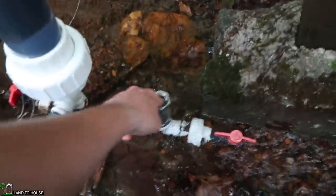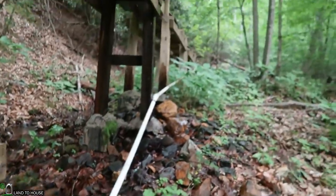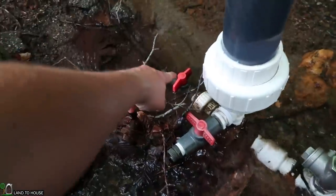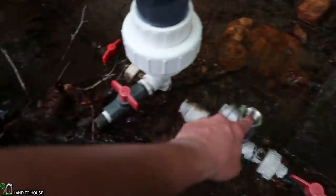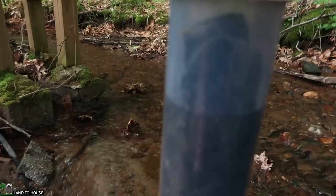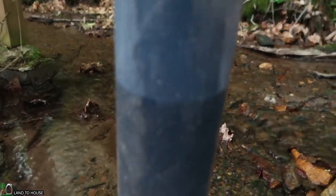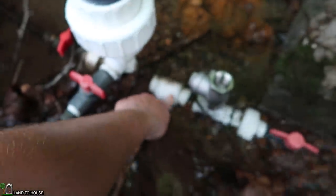You can see the water is coming to the pump just fine, and there's no air in the drive pipe. So if I've got the delivery closed off, that basically lets me know that there is not an issue with back pressure. So it should start on its own here — the air level inside of my clear pressure tank goes up when it cycles, and then it goes back down. So what's happening is a leak, and I'm assuming it is in this inline valve here.